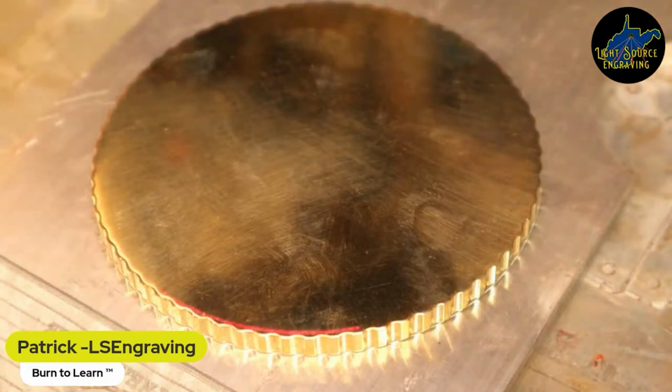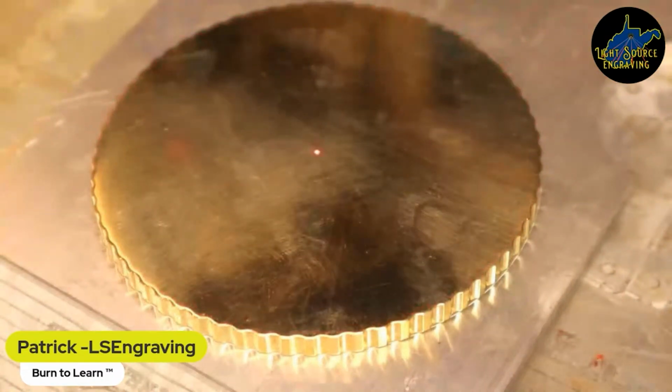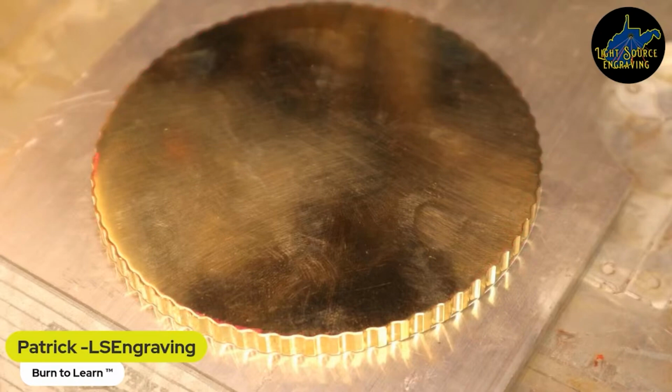So what I'm going to do is increase the size, probably by a millimeter to start. Because when I show you what this graphic looks like, you'll see why we want the white edge of this graphic to be hitting on the outer edges of the outer part of the scalloped edge. So it does engrave some of that away. Otherwise, you'd have an engraved inset and have those little spiky things sticking up.